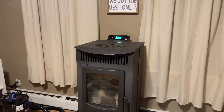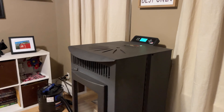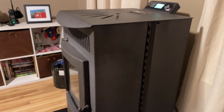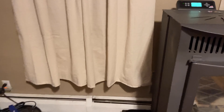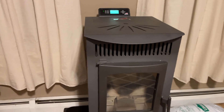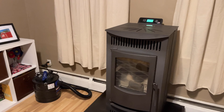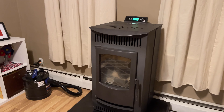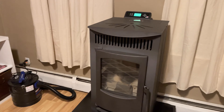I know some people are going to say why those curtains are behind there — the back of the unit does not get that hot. There's no radiant heat back there. All your heat is going to be up in the front, which gets extremely hot — we did get something burned against it in the past. Beautiful stove, got it at Home Depot for about $1,100. For the smaller house I have, this thing heats the whole downstairs perfectly. It's vented out the back with fresh air coming in and discharge on the other side.